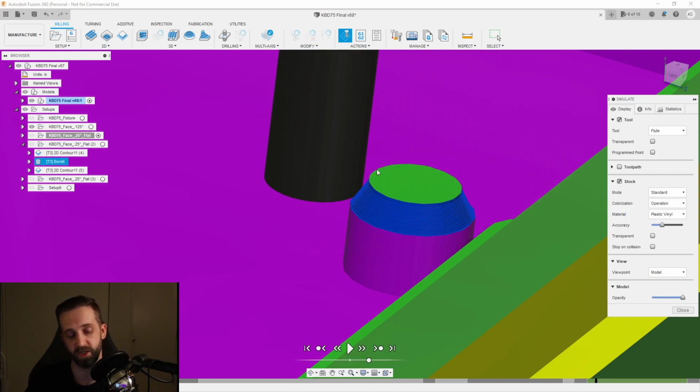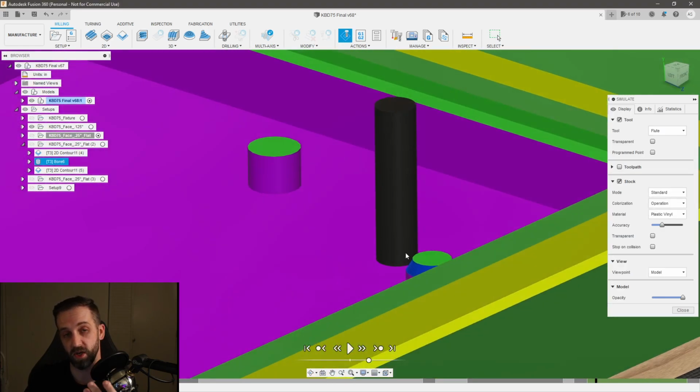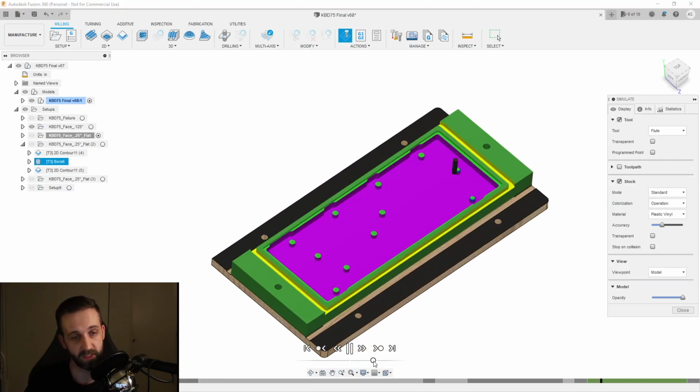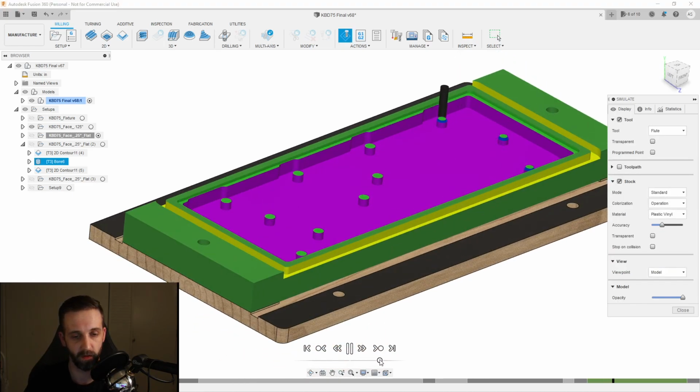And the reason that chamfer was important is because the part of my circuit board where it was touching was only as round as this green surface right here. I couldn't have the full diameter go up, otherwise it would hit some of the circuitry. What was cool about that is that it allowed me to not have a tool change. So I could do all of that without a tool change. So we're still working with the same bit, and I haven't re-zeroed the part yet. And then it's going to come through and do that to each hole.